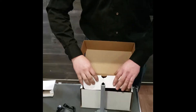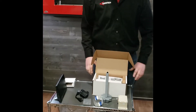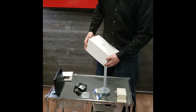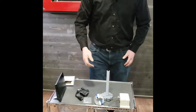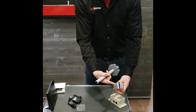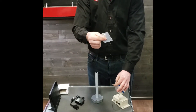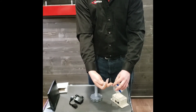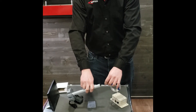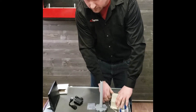I'm going to show you quickly how this thing gets connected up. When you have your tubing, you cut it to length as explained before. You can heat up this end a little bit. What you want to do is open this up, get the clamp out, put the clamp on first, then the bushing, and push it on to the barb. Push the bushing on and clamp it. This is all illustrated in the instructions very well.